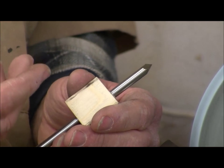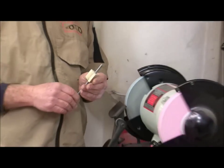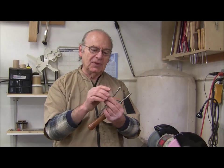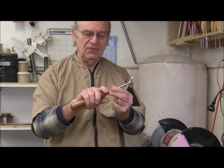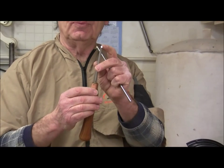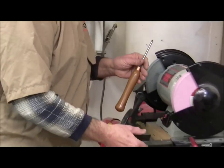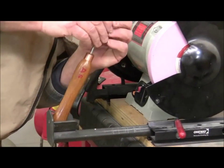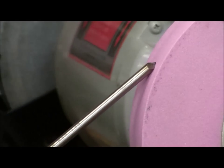It's very easy to grind. Now that it's put into a handle, I'll show you how to sharpen it using the Wolverine jig — very easy. One recommendation for the handle: don't make a big handle because it's a small tool and you won't be able to feel it. Once you get it into a handle, to maintain those three edges we use the Wolverine jig here. Just put it in the V-piece adapter and what we want is one of these faces touching the wheel all the way. Once you're there, lock it — you're ready to go.